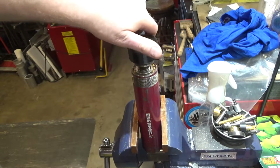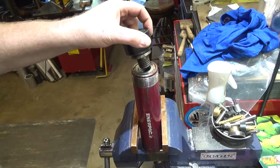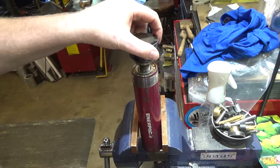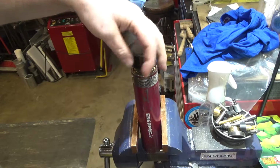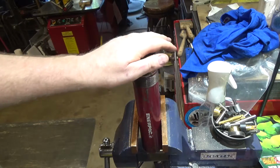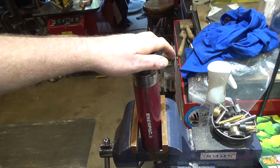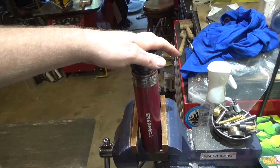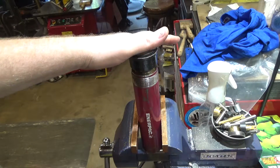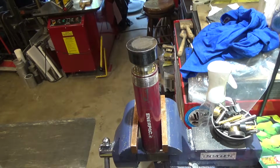So I do hear air there. Maybe some air leaks by through around the nut, but hydraulic fluid's viscous enough that it can't. I know that sort of feature works to the advantage sometimes of hydraulic systems, where it's not an absolutely perfect seal as far as airtight's concerned, but hydraulic fluid's viscous enough that it can't make it by the various seals. But it does work very smoothly now, and it doesn't leak fluid all over the place.